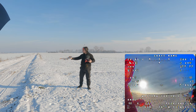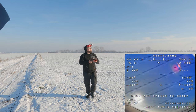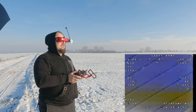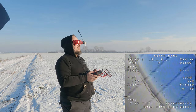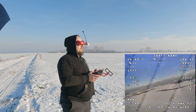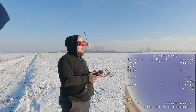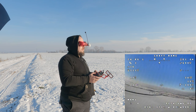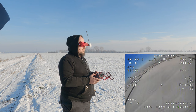First a few quick preflight checks that everything moves in the right direction, then we can launch. I'll narrate this in English — during the flight I made German announcements. My panic kicked in because the plane was massively pitching up and down. I tried to get my goggles down as fast as possible since it launched into the sun and was hardly visible. There's a lot of noise in the video, probably caused by a bad flight controller or bad ESC — I wasn't able to fix that even with a capacitor. I even switched into manual mode and still had massive problems controlling the pitch axis — every movement was extremely delayed and didn't react as expected.